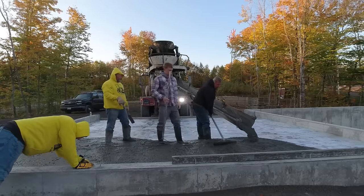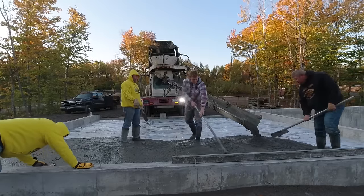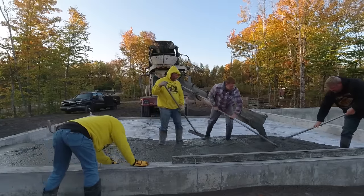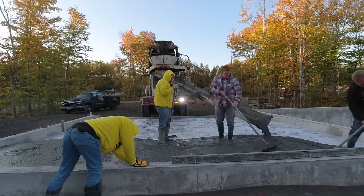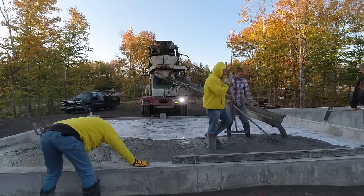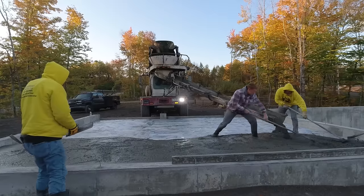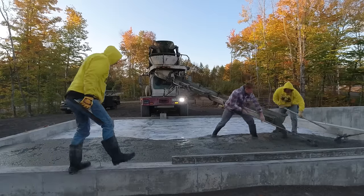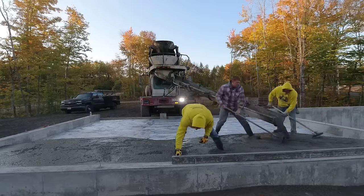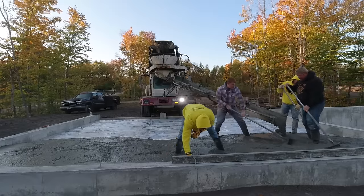What we're going to do today is pour a two car garage. I left it pretty much in real time, so the video is just over 20 minutes long — that's exactly how long it takes us to pour a garage like this and get it loaded. Then we'll leave one or a couple guys here and the rest of us will go pour something else or set up jobs — a pool deck, a slab, a patio, a walkway — or go get grades on other jobs where we have to snap our chalk line, put styrofoam down, and wire mesh if they want it.